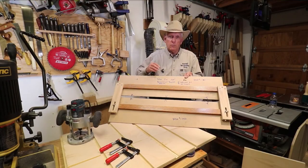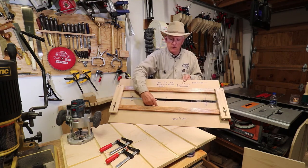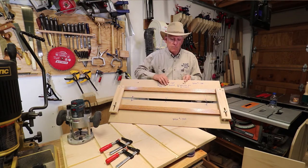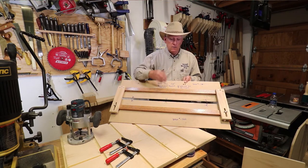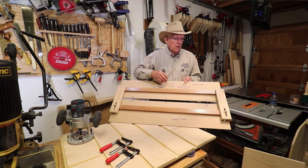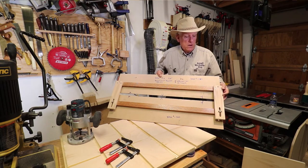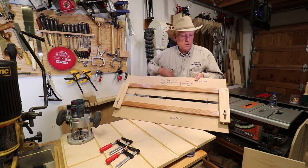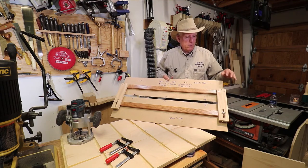It's only usable as a jig for that router base with that bit for these rails to be the perfect distance, so mark your jigs so you know what your setup is. If you throw a half-inch bit in what's supposed to be a 3/8-inch setup, things are not going to line up. The next piece is just 3/4-inch plywood, 10 inches long — cut a slot in each of them so you can put a T-bolt through and use wing nuts to secure them.